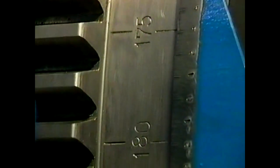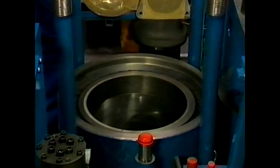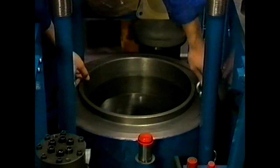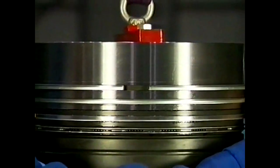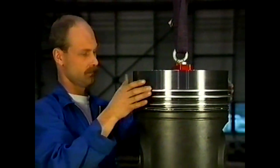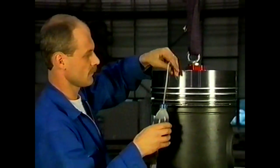Turn the crank of the relevant cylinder to bottom dead centre and clean the cylinder liner before the piston is installed. Provide the guide ring on the top side of the cylinder liner to guide the piston rings into the liner. Divide the gaps of the piston rings above the gudgeon pin at an angle of 180 degrees in relation to each other. Apply a proper layer of clean engine oil to the piston rings so that the piston can be mounted smoothly in the liner.